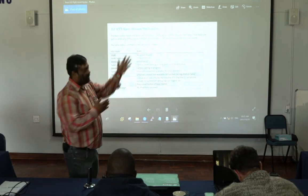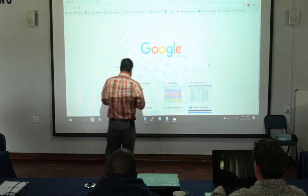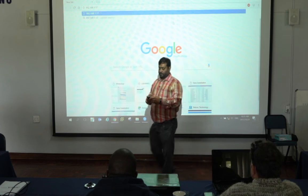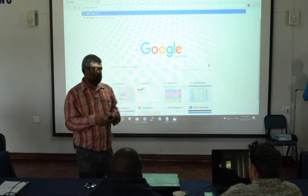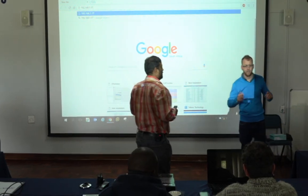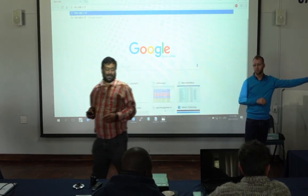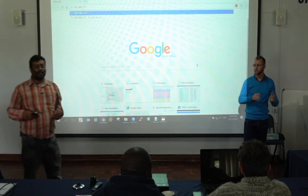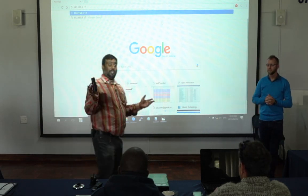Right, we've plugged it in. We've got our green light. We need to know what the IP is on that. Anyone have any ideas on it? 192.168.1.1. Now? Okay, remember, Dallin's question is, Dallin said the device is running on DHCP. So what is that DHCP range that we've got? 192.168.1.10 to 50. Okay, so it's got an address somewhere in there. Yeah. Okay, are we agreed on that?